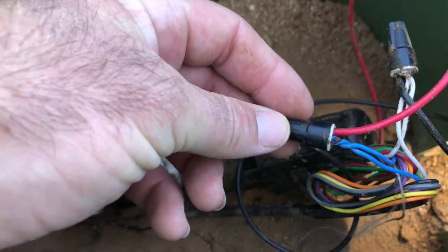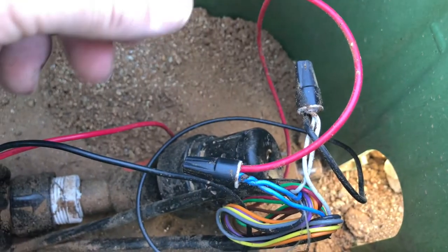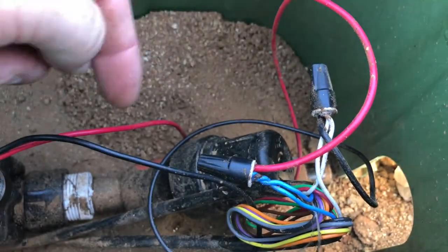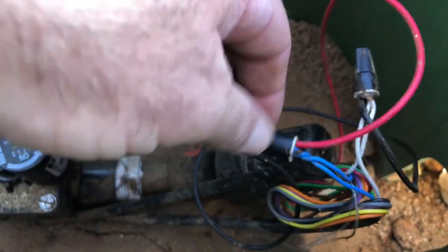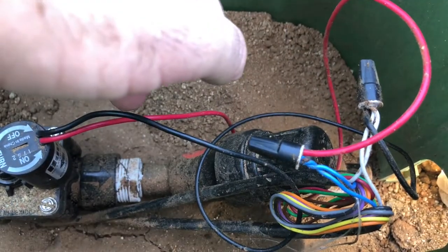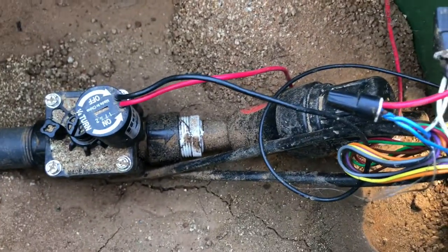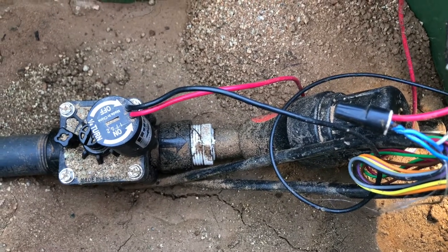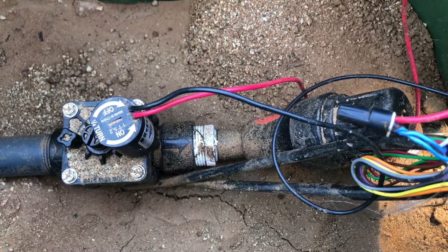On the wiring side, make sure one wire goes to white — that's your common connection. Don't twist it too much or it can break off inside; just get it snug. The other wire from the solenoid goes to one of the colored wires — blue in this case. Don't connect both to the same color on the main wire run. Go back to the controller, try it out, and oftentimes this will fix the problem. Hope this helps — leave any questions or comments below, thanks for watching.